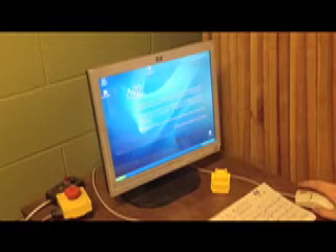Next, go to your USB stick and find your part, then drag it onto the desktop. Then go ahead and open up ShopBot. Once ShopBot opens up, you can hit K on the keyboard and that will open up the keypad movements.